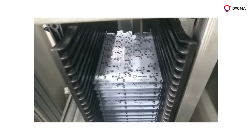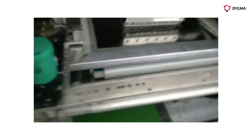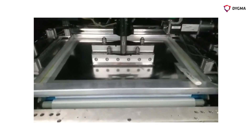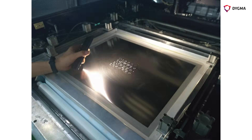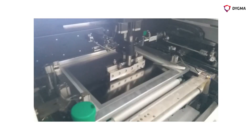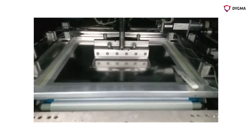The circuit boards start off in a hopper at the beginning, all racked up. A little arm pushes them out into the stencil machine, which is way cleverer than I originally noticed. They use little markers on the board to make sure it's exactly in the right place for the stencil, and then the solder paste is squished through. The stencil is 0.12 millimeters — very thin, like a silkscreen but made of steel.